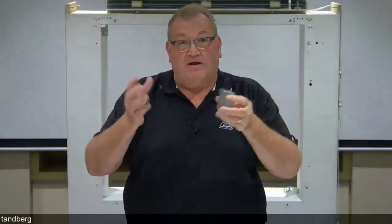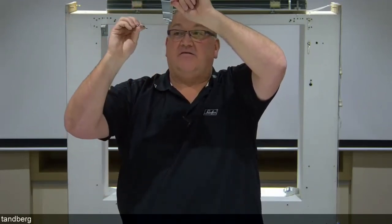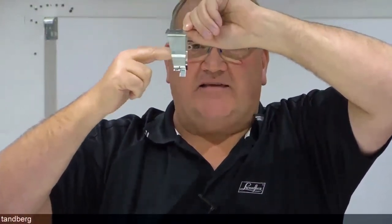If you're fitting inside a bulkhead or pelmet and can't slide the blind in from the front, you can call up the VB 50mm reveal bracket. This bracket can be top-fitted, then the blind comes up from underneath and clicks in. A locking plate then slides along the bottom and locks in place to hold the Venetian and stop it falling down.